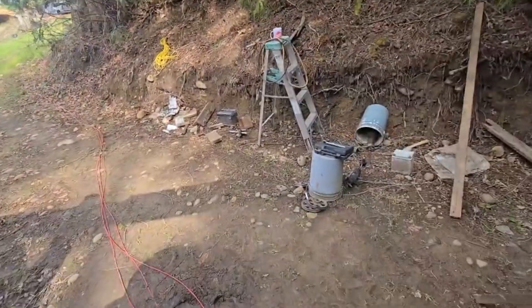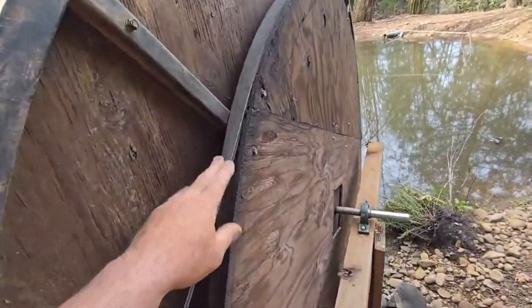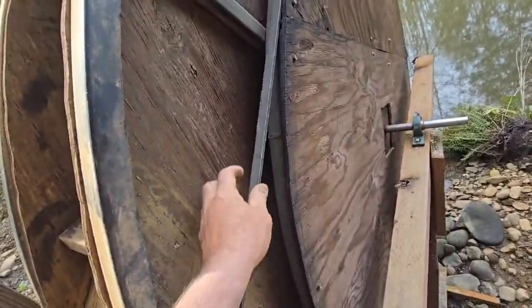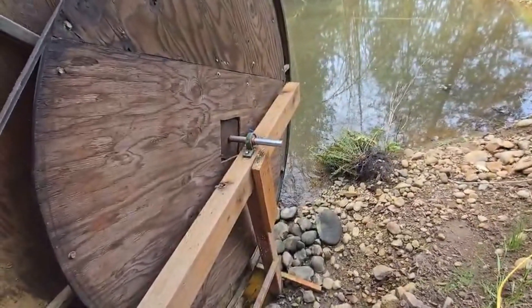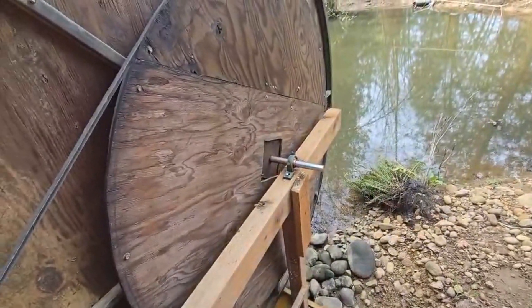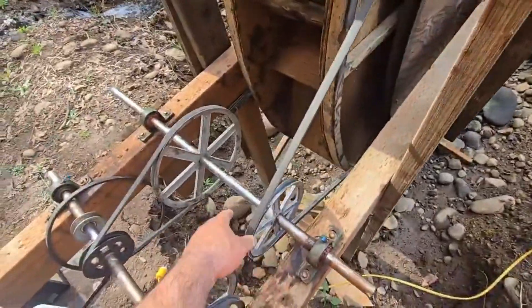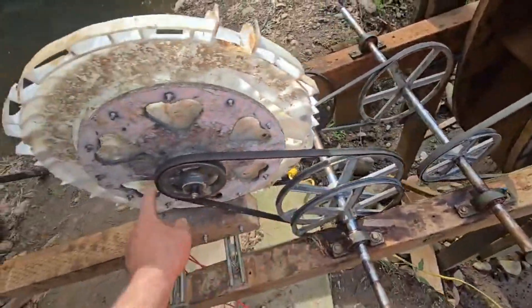On the other side we have a five-foot reel — this outer piece right here is a five-foot rim, and it's bolted on to this rim, so when the wheel turns it's actually using a five-foot wheel for its torque. Definitely go with at least an inch-and-a-half shaft — we tried a one-inch and it broke. The pulleys are all one-inch shaft. This is an 8-inch pulley, so we're going from a 60-inch to an 8-inch pulley, to a 12-inch pulley, to a 3- or 4-inch pulley, to a 14-inch pulley, to a 5-inch here.